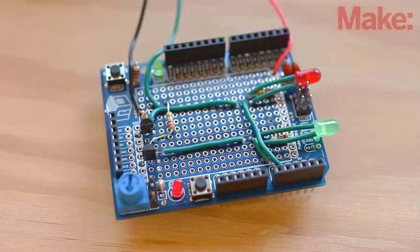Now that you've confirmed the circuit is working, you can permanently solder the sensor circuit into the maker shield. At this point, you'll wire the Arduino to the circuit so that it can detect the water level in the bowl. Connect the collector of the low transistor to input A1, and the collector of the high transistor to input A0. The bowl's base probe will be wired directly to 5 volts on the shield.